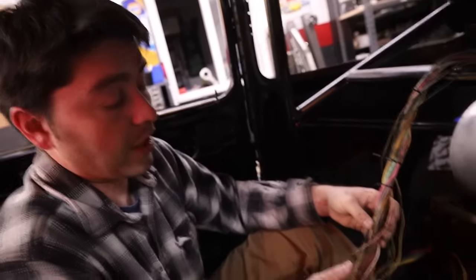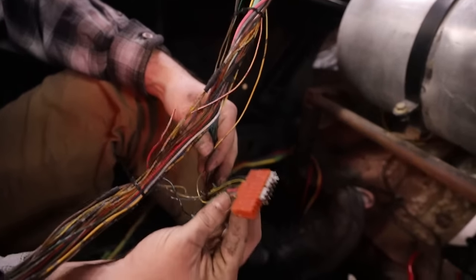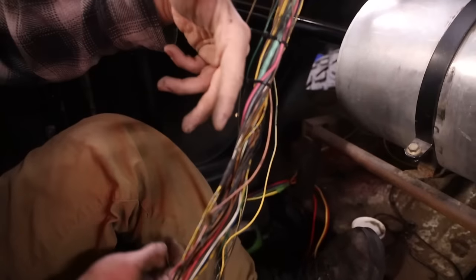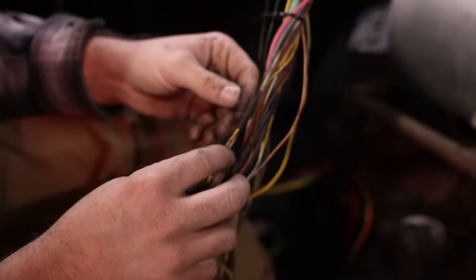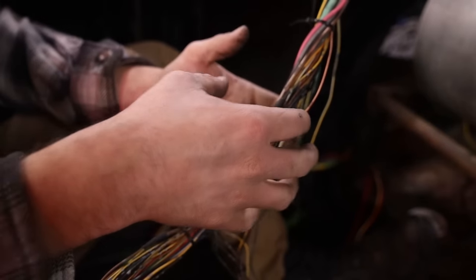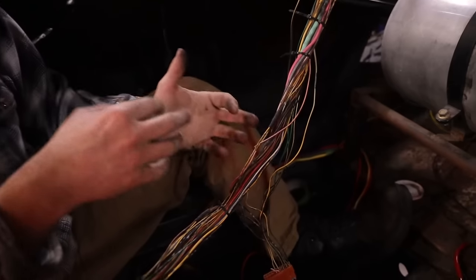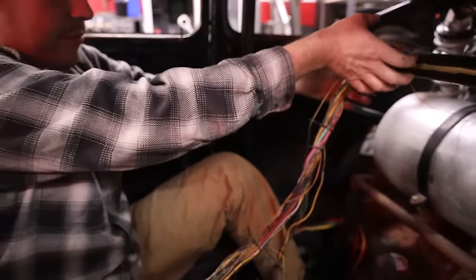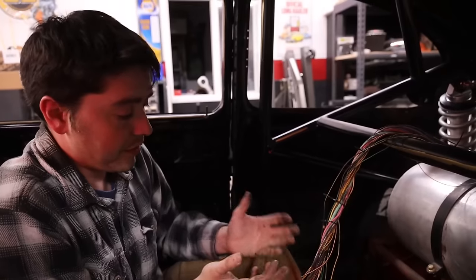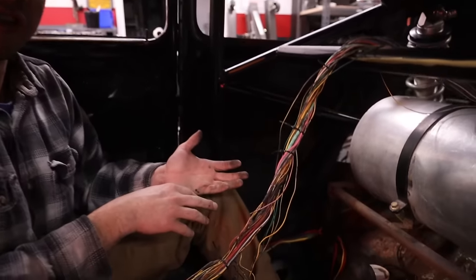So you're going over this, and you're going to solder this system. Correct. As I mentioned before, we're trying to get rid of this. This does not need to be there. The stuff's already bridged. What we're going to do is combine the like wires, and we're going to stagger it. You want to stagger your soldering so you don't get a giant clump of a mess of everything in one location. Because if you get everything in one location and you want to make it all nice and streamlined, it's just going to be this giant clump. Exactly. So this not only looks better, it looks more professional.